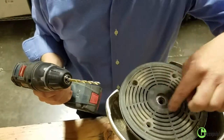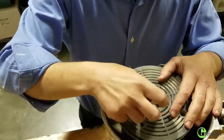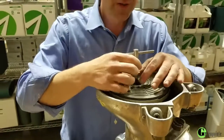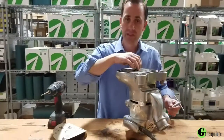Then take your vacuum cleaner, put it right over that hole, suck all the grit out — do it several times and that should take care of your problem. Run the bolt down in without any sandpaper on it and use your wrench a couple times just to make sure it's all clear. Vacuum it out one more time and you're back in business.